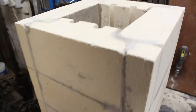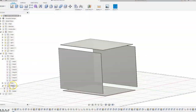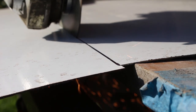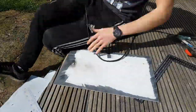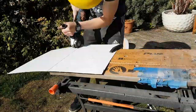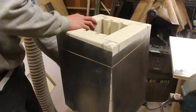This is what the main chamber looks like once all of the bricks are complete. Now it's time to start working on the frame and the first thing I'm going to do is start working on these sheet metal pieces which are going to cover up the bricks. For the sheet metal I'm using 0.8 millimeter steel that I got from an old dishwasher. This is painted so once I cut it with the angle grinder I had to remove all of the paint since when it gets hot I don't want it giving off weird gases. I'm then going to coat it again later on with some heat resistant spray paint.